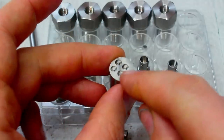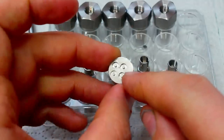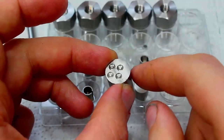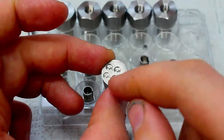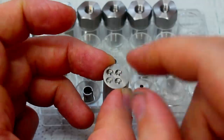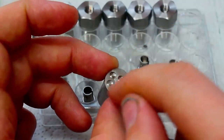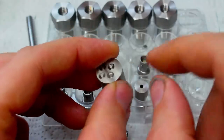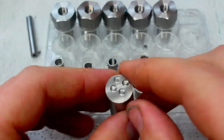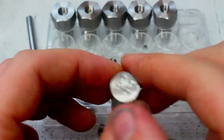And this created this feature, and this looked like a winning strategy. Great finish. The pin was very, very round. It's fast. The diameter of the pin and the ID of the hole was very precise. So really a good process, very stable.